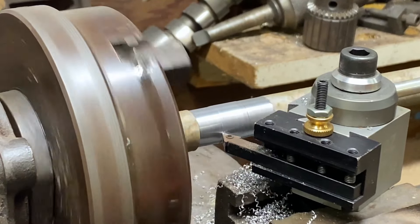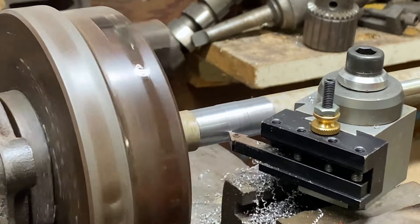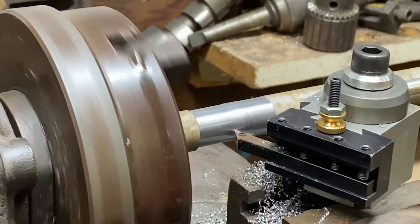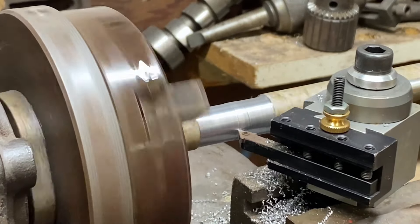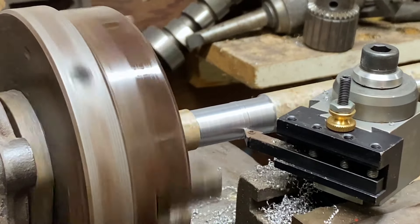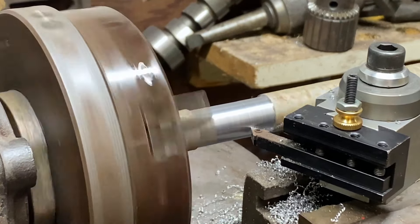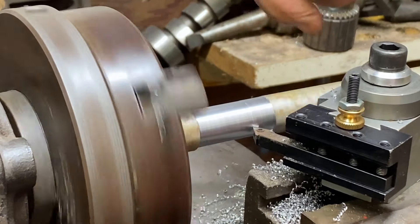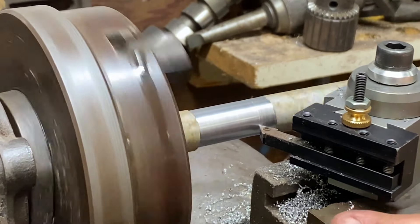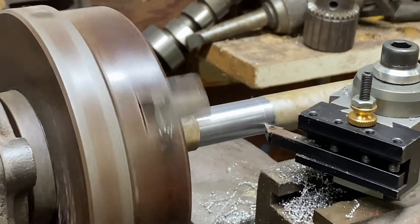This is just an old piece of steel rod — I don't even know what it's from, I just found it upstairs in the warehouse and thought it's not hardened steel so this will be fun to play with. Probably at some point I'll remember what that's for and kick myself. I had actually turned this down a little bit earlier so it's not quite as aggressive here. Beautiful curl coming off of there, really happy with that. We just need to adjust this up, it's down a little low, but that's a quick easy fix.